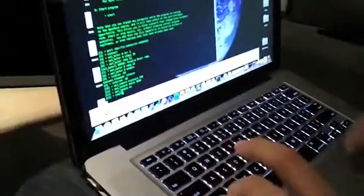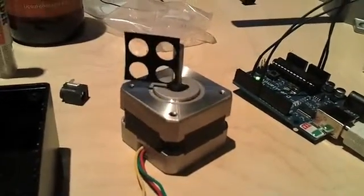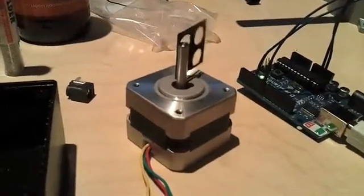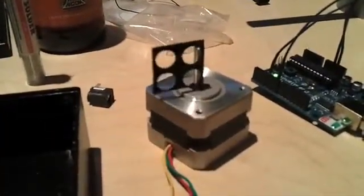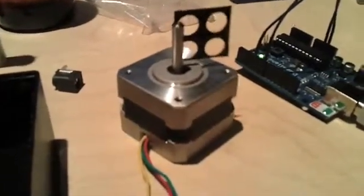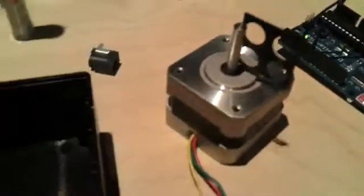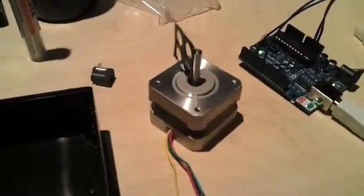Alright, so you've got all the parameters entered into the Perl script. We get ready to hit start on the terminal, and there she goes. While this may not seem that exciting, keep in mind that when hooked up to a geared head and a slider dolly, these little turns will do something pretty cool. The reason it stops between each movement is because it's pinging this optocoupler down here, which is going to send exposure and focus signals to the camera. So between each step the camera will take a shot, and that way you don't have a camera taking a shot while in motion and getting blurry.